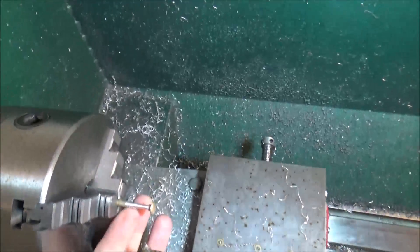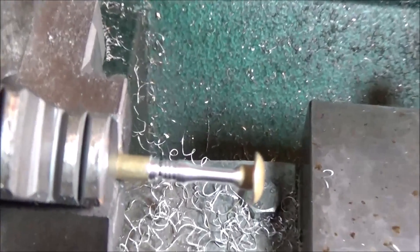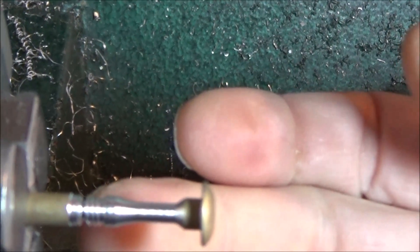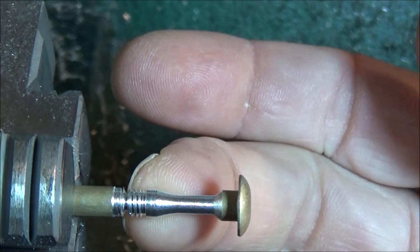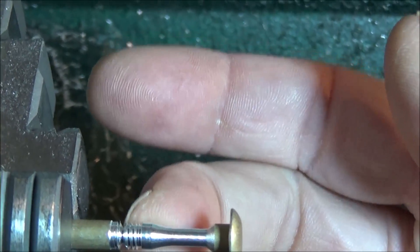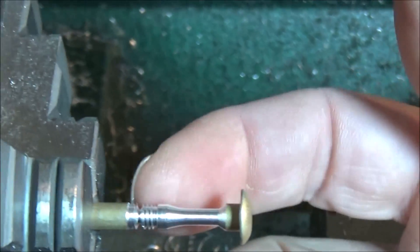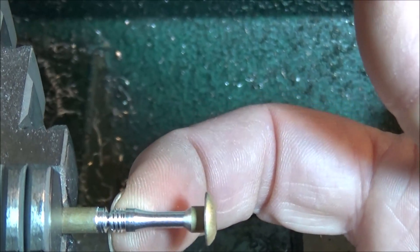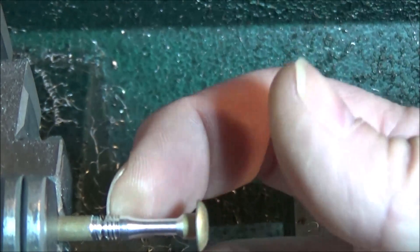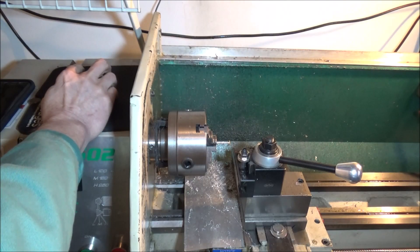You can see it does a pretty good job of threading. The last little bit of code I hand-wrote, and that's just to chamfer the end of the bolt. Normally you would thread on the end of your stock, but because I'm reworking some rivets I'm threading actually towards the chuck. I needed a little chamfer there before I part it so that I don't have to redo the start of the threads — this makes it easy to just thread it right onto the nut.